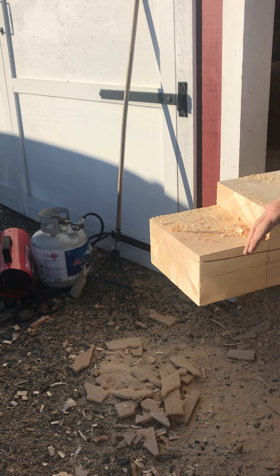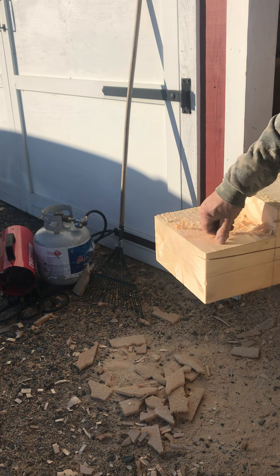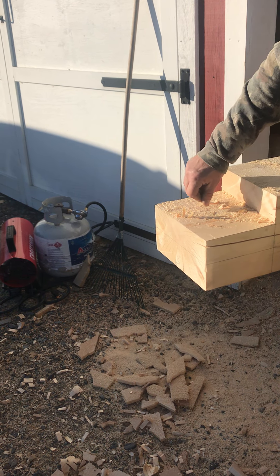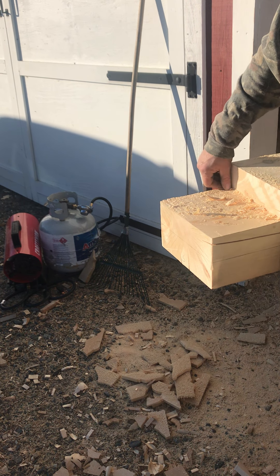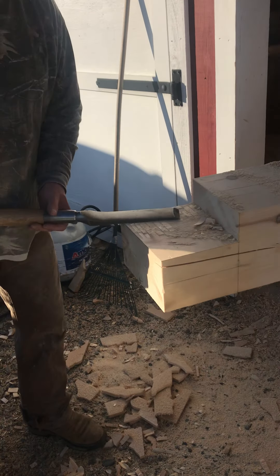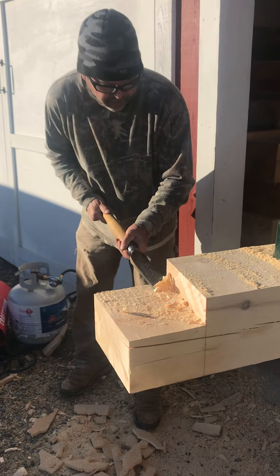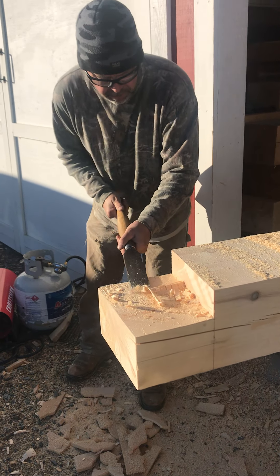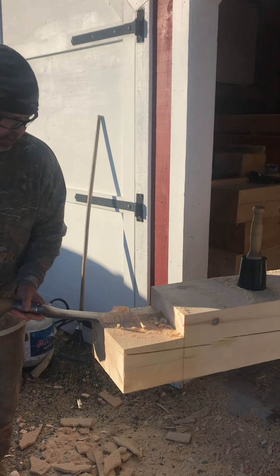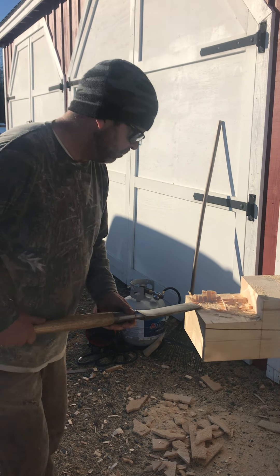After slicking and cutting the other side, the tenon gets cut at an angle — 7/16 on one side and matching on the other, per the plan. He'll double-check the measurements. We'll come back after he's completed this side and the next side to see what else he does to complete the tenon. Thanks everyone for watching Saunders Homestead — if you like what you see, hit the like button, and subscribe if you want to see more.